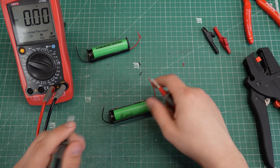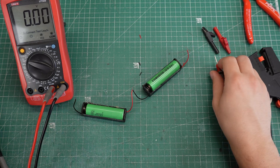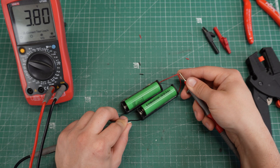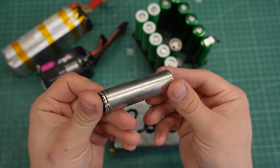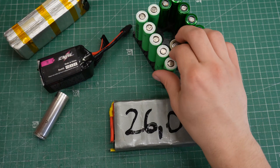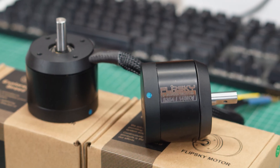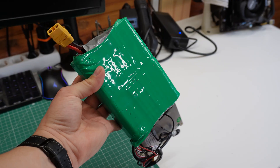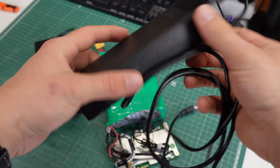When we take two battery cells, we have the option to connect them either in series or in parallel. Series connection adds the voltage, while parallel connections give us the sum of the capacity and input and output currents. The most common cells we'll be working with are lithium ion and lithium polymer cells. Both of these cells, when fully charged, will have a voltage of 4.2V, so a 12S battery will have 12 times 4.2V, which is 50.4V in total. Now we know that my motors can take 50V, while the controller can handle a bit more. Since all of my previous builds were based on 10S and I already have some 10S chargers, I will be building a 10S battery pack again.